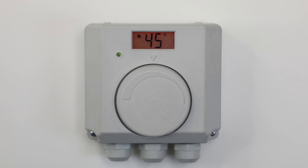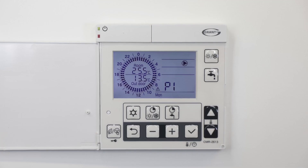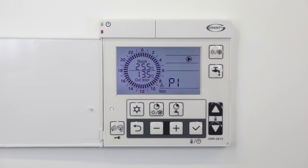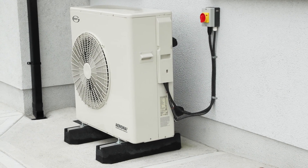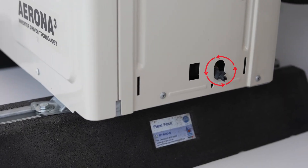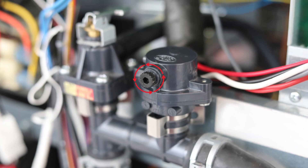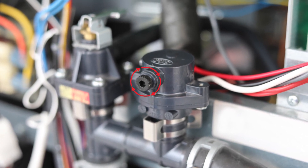The design cylinder temperature will be later set during commissioning. If the heating system isn't properly vented, a P1 code may be displayed, meaning there is air in the circulation pump. The simplest method to vent the circulation pump is to isolate the electrical supply, open the drain valve a little to release the air, and then close it when cleared. Then open the internal air vent to remove any remaining air and close when completed.